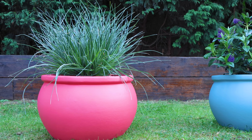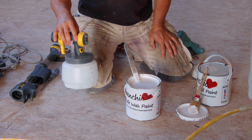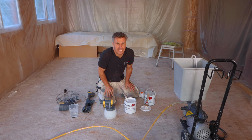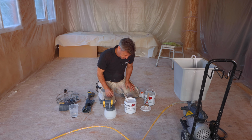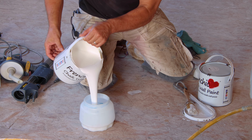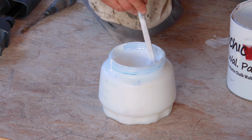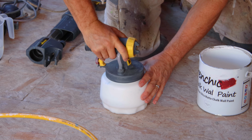and Mrs. DIY. I'm often asked, can I use Frenchic wall paint in my Wagner paint sprayer? Well, the answer is yes, as long as you dilute it a fraction. Give it a good stir up in your can first, then pour it into the reservoir and add between 5 to 10% water. Stir this up, connect the head, and then you're ready to start paint spraying.